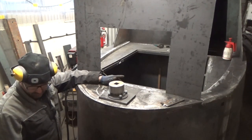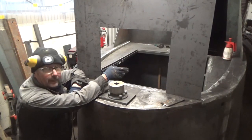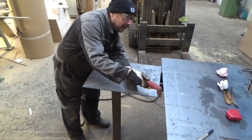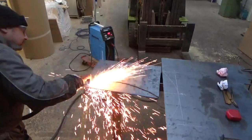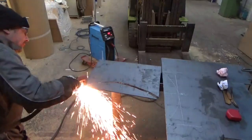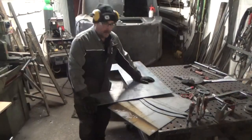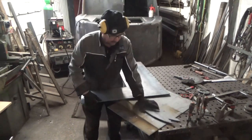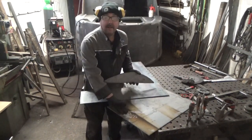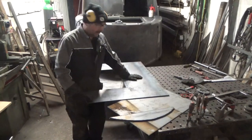So now what I need to do is radius a piece of steel this height that goes in here and clears that swan neck, because it goes inboard quite a bit. So that's the next job. I'll figure out the radius we need, cut some steel, and we should be able to form it round. Right, so we've got the radius — 100mm from there to there. We've got the components now: the back plate, the two radius pieces top and bottom, and the plate that will become the radius back plate. Give them a quick fettle and then we'll get on with it.